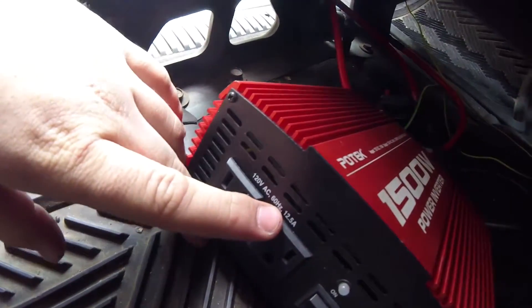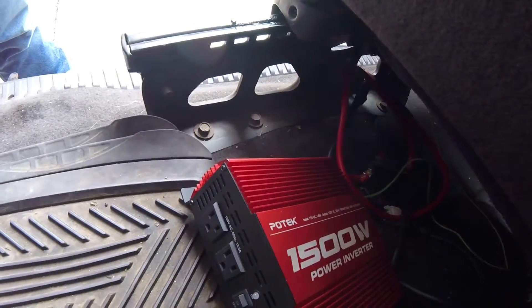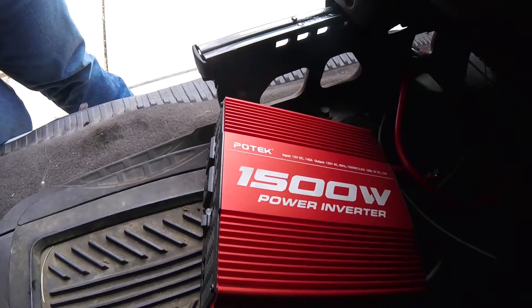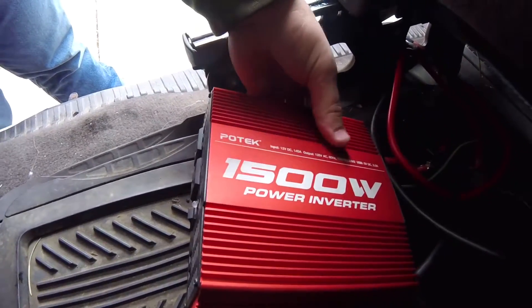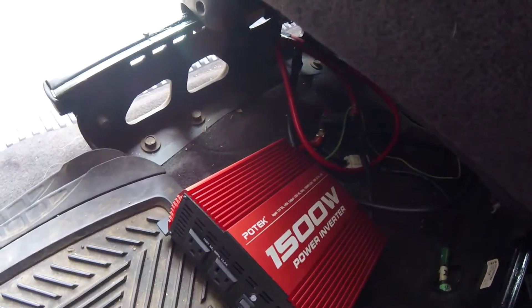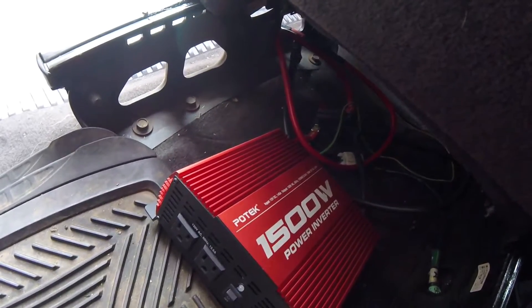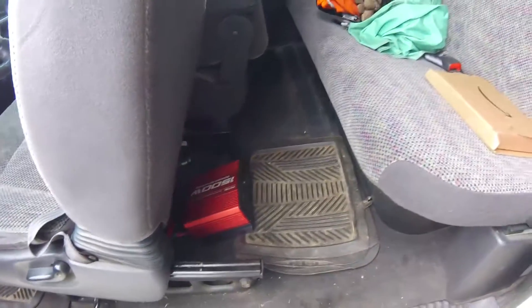As long as you follow the amp rating — you can usually look them up online — you'll be fine. Just note the difference between peak watts and RMS: if your inverter is rated at 1500 watt peak, you'll only be able to run about 750 watts consistently. Whereas 1500 watt RMS — which I'm pretty sure is what this is — means it can do 1500 watts continuously. A lot of electronics spike in power when you turn them on, so a power tool that draws 300 watts might spike to 600 for a second. As long as you do your research and are careful, you can power a lot of cool stuff.